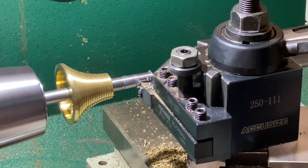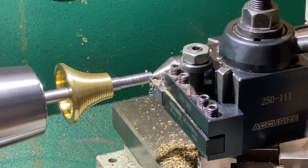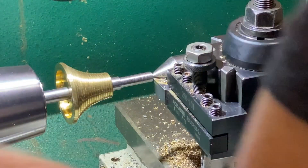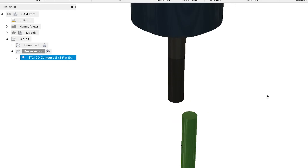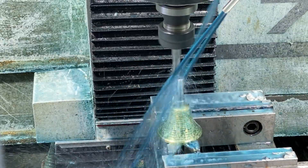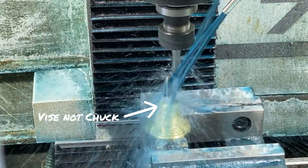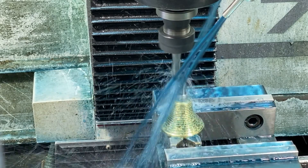Once that's all done, it's about cutting the shaft for the Fusee that's going to go into the clock frame — getting it down to the right diameter for the bearings. Once I have that, it's about putting that keyway slot in there. You'll see this in Fusion, what the operation will look like. Then you can see I use a V-block to get it nicely aligned in the chuck, and come down with that operation. It does a super job of cutting that square keyway.